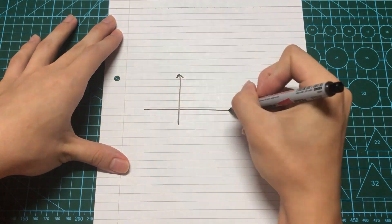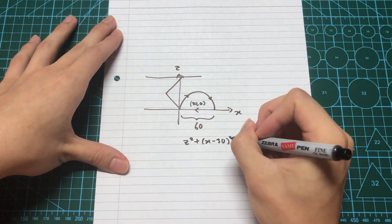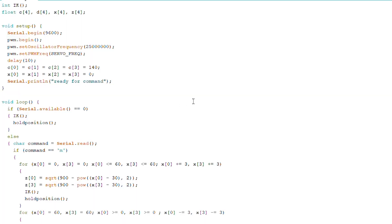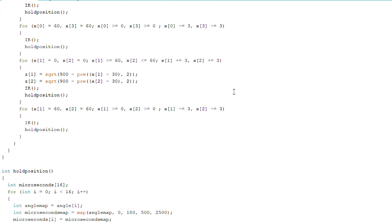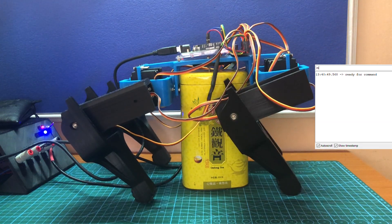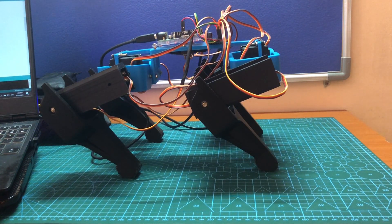So now that its legs can receive inputs from the Z-axis and the X-axis, let's make it move in a semicircular path. Here's the trajectory that I plan for its legs to follow. The equation for this is quite simple — it's basically just a circle formula. I'm going to control it using the serial monitor. Remember to subtract Z from your equation here since the legs will retract and extend during the trajectory. So let's try it out. Everything seemed fine so I decided to let it work on the table.